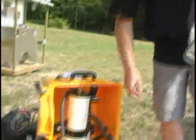What we're going to do now is go ahead and turn this on and fill up that bowl. It's going to take a little while for that filter to fill up, and once we have some oil coming out the end and we know it's representative of what's in there, we'll take a sample.